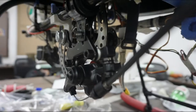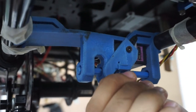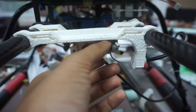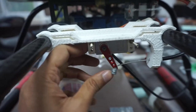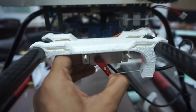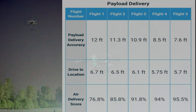The airdrop mechanism is a simple yet efficient powered descent mechanism. Until the desired drop location is reached, the UGV is attached to the UAV base via a latch. When the target drop location is reached, the latch disengages and the UGV descends as a nylon fishing cord unspools under the weight of the UGV. An actuator-triggered disc brake mechanism acts as the control mechanism and slows down the rotation of the spool as required. This method of controlled descent makes the payload less susceptible to changes in wind speed, and a high degree of accuracy in the drop location is obtained.